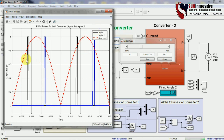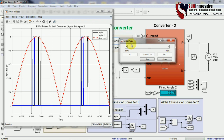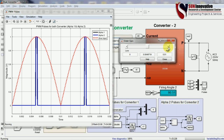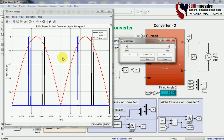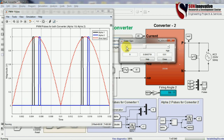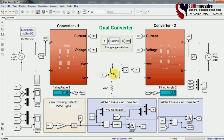Changing the pulses, you can see the middle point at which the firing angle is purely 90 degrees — at this point converter 1 produces zero voltage because both converters have equal values and produce equal voltages. Increasing the firing angle shifts the signals from right to left and the firing angle is automatically adjusted. By changing the slider gain value you can change the firing angles of alpha 1 and alpha 2 accordingly.